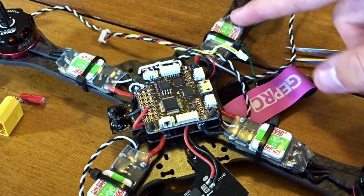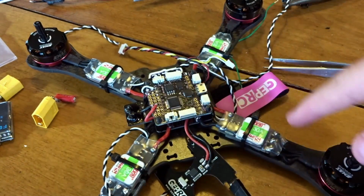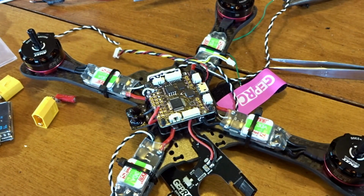So you're going to do this motor up here to number 2. They're labeled 1 through 8 on here, so this is number 1. This ESC is number 2, number 3, and number 4. So just line them up on the pads, do the signal and the negatives. I'll have to tin the negatives. I realize I just missed them for the grounds there. And do the rest of the 3, and then we'll be back when you're done with that.